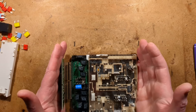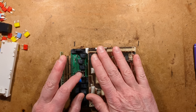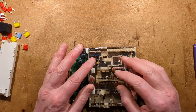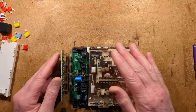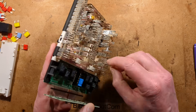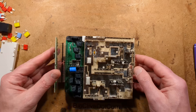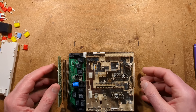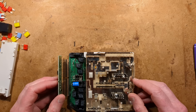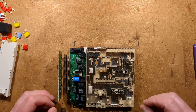So when you buy a replacement for your car, should you ever need one - and incidentally, this type of unit can sometimes be mounted in the weirdest places like behind a headlight where water can flood in. This one is surprisingly clean; I do see a little bit of the green crusties as EricO says on some of the blades, but other than that it's surprisingly dry. If water does get into these, it's usually goodbye controller - so much damage, especially to the circuit board, that you just have to get a new unit at ridiculous expense. But there we have it - the humble automotive fuse box, not quite as humble as it looks.